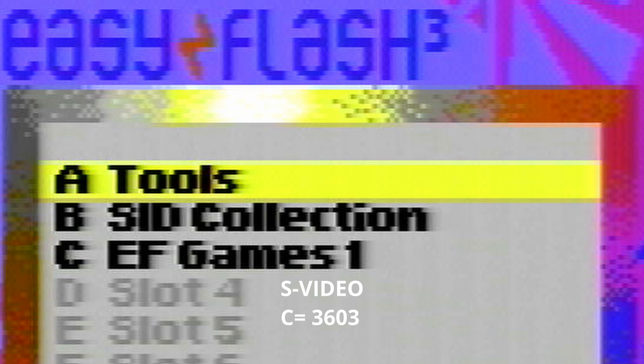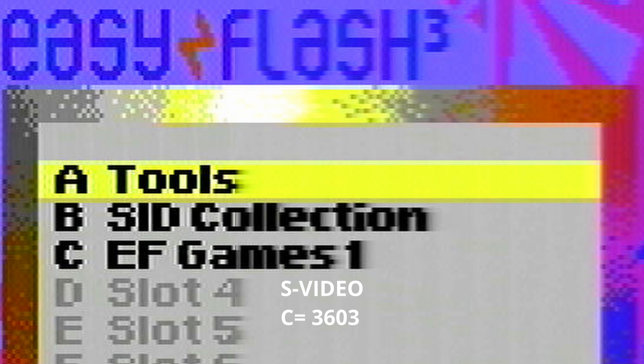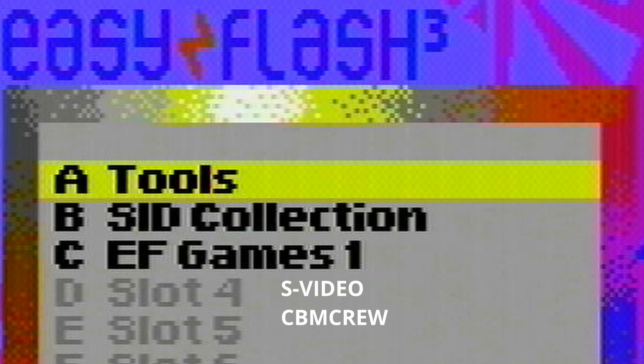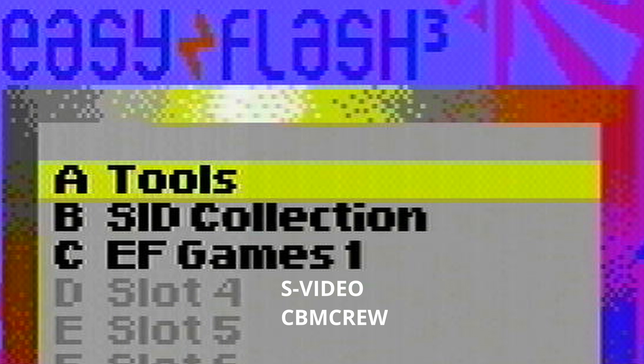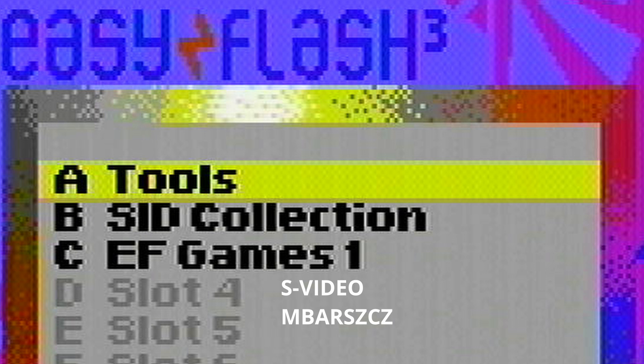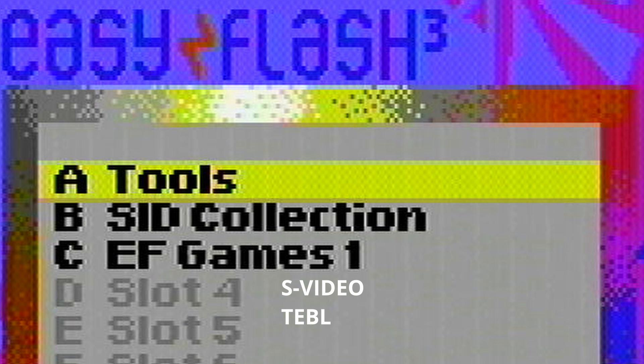If we zoom in on the 3603 we can see a good amount of smearing. This is pretty much corrected for the most part with the mod by Adrian Black. Moving on to the CBM Crew, the white box has gained a little bit more detail but again everything is a little bit darker with this replacement. Stepping up from that, Matt's RF mod lightens everything up a little bit but is still somewhat blurry. And then T-Bull's mod sharpens everything just that little bit more, but now we're also seeing a decent amount of checkerboarding, probably from sharpening everything up so much.